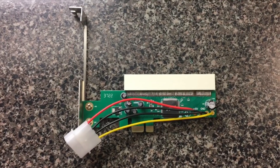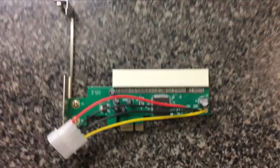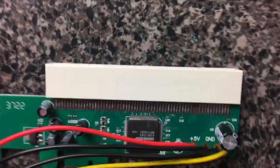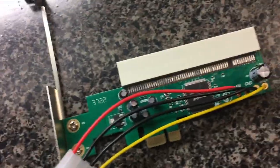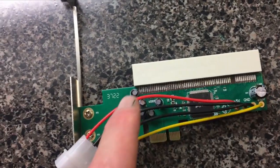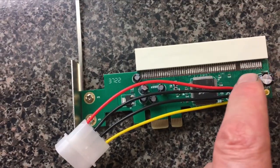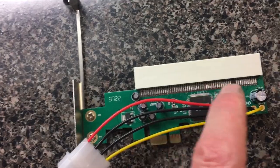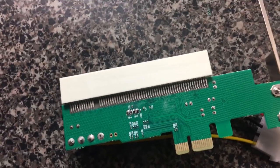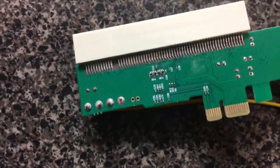This is a really cheap bridge card I got off Amazon for like $18. I'm expecting it to work because it's got that proper chip that's designed for that. I inspected this card and found there's a little bit of sticky stuff up at the top, and also a little bit of an overshoot of the solder — kind of looking for bridging. I didn't see anything really wrong with the solder, but there's a little bit of extra solder stuff stuck here. You don't want free solder going into things, bridging traces, destroying components, making things erroneous.